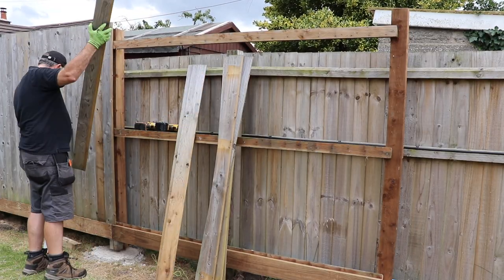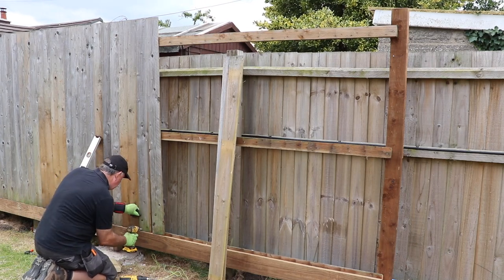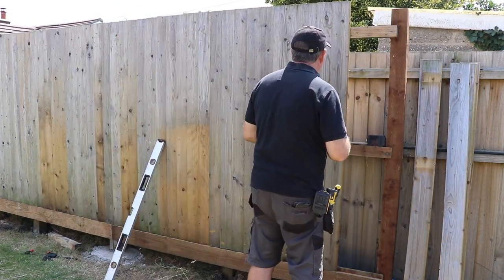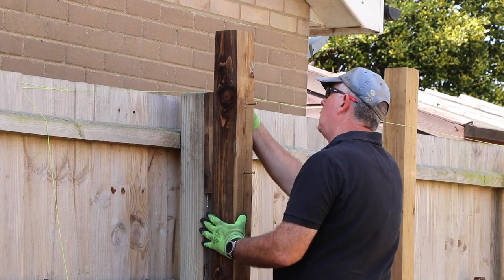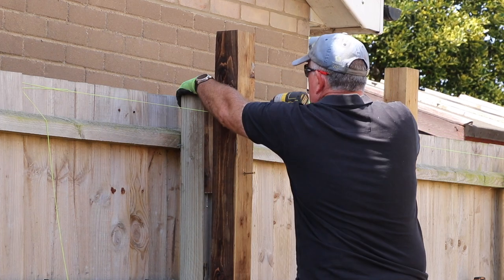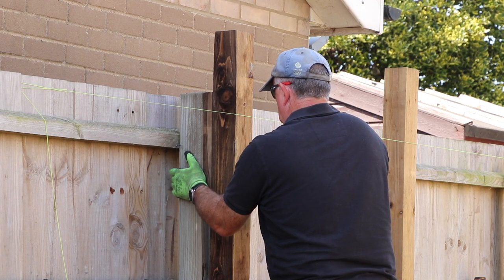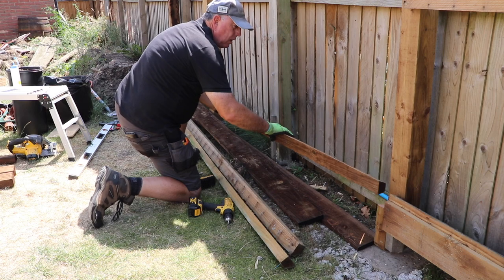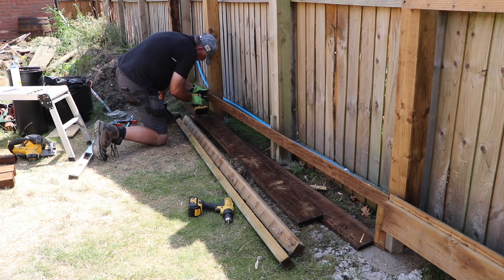With the pipe and cable installed, I can now carry on with the feather edge boards and the rest of the fence structure. On some of the old posts that are secure but leaning, I fitted a new post in front with a spacer so they can add support but now in the correct alignment. With the posts in place, the cantrails and the gravel board can be fixed. The ground here is eventually going to be made up, so the gap at the bottom will eventually disappear.